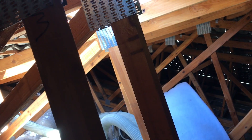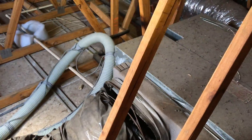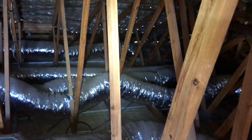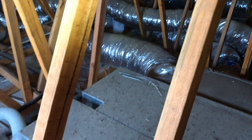I'm up in this roof putting some polyester in around the manhole and the downlights before we pump it with cellulose. They've got a ducted system in here, these are the condensers, and after we finish the job they've got this little drip tray down here and we make sure we blow all that out and clean it out.